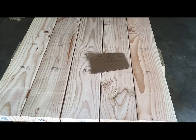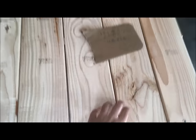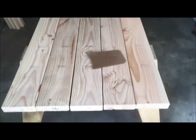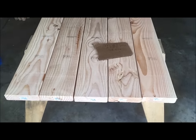work on this one. The very first thing that I do is lay 5 2x6s facing down. I'm going to build this table laying on its tabletop because it's easier to manage and just the assembly is easier with it sitting this way.